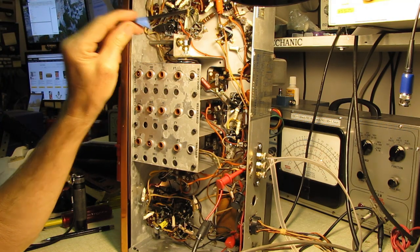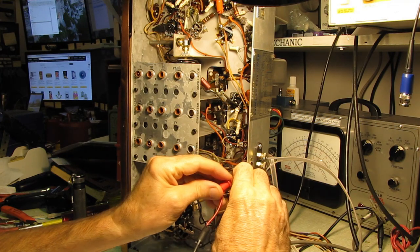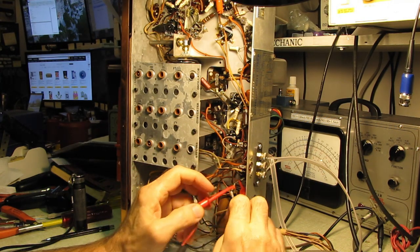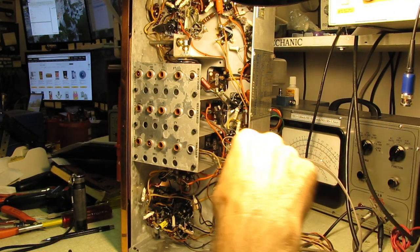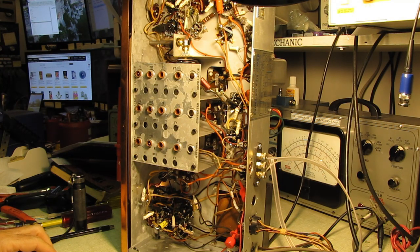Now, this one is our ratio detector. Let me get on an FM station. Let me disconnect the signal generator. Oop, don't rip that wire off. You just barely got it soldered back on there. Those little wires are 6/1000ths of an inch in diameter.